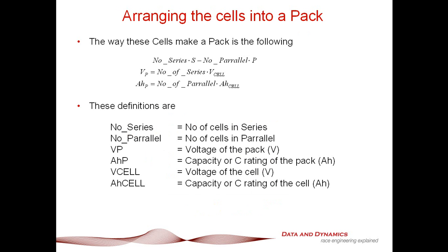Obviously, a battery pack is not made of one LiPo cell — it's made of many. Here's the lingo: when we specify a LiPo pack, we start with the number of series (S) and the number of parallel. The number of series is how many packs you've got concatenated together. The number of parallel is how many of those individual packs you have in parallel. The number of series determines how much voltage you get; the number of parallel determines capacity.